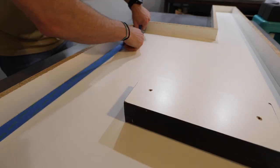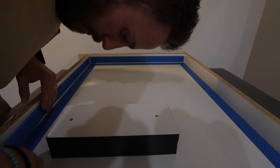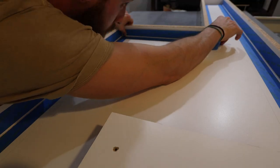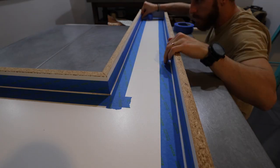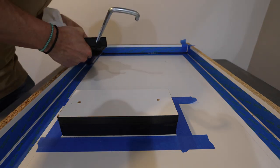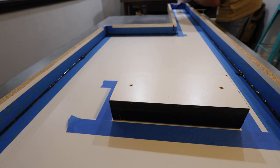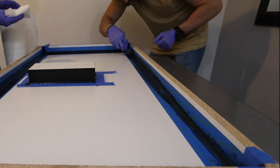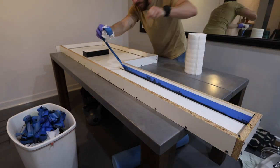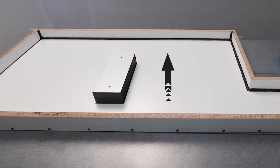It is very important to caulk the corners of the mold. To do this I masked off a small gap with painter's tape. You can use any type of 100% silicone caulking but I find it's easier to use a dark color. I added a bead of caulk to each corner and smoothed it with my finger. You can also use a special tool made for caulking. Before it was fully dried I removed the tape. I later decided to add more caulking to the front edge of the mold only — this way the edges against the wall would be more squared while the front edge would have a nice rounded finish.